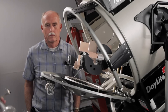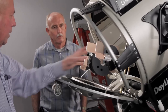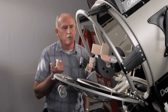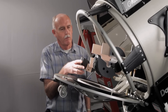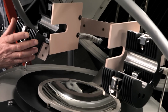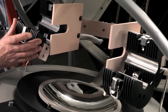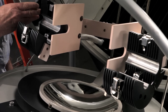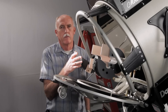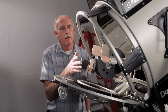Before we put the bulb back in, Bill, why are the sockets so big? Because of the additional 6,000 watts from the 24K, we decided we needed bigger sockets. With some math calculations, we came up with a formulation for the surface area needed to radiate the maximum amount of heat. We also painted them black so that, as a black body, they radiate heat at a faster rate than bright nickel-plated sockets would.